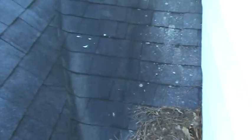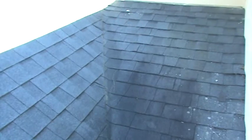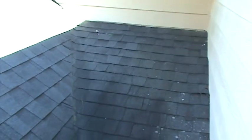And here's a skid right here, another toe board hole right through the shingle. That's an active leak. And everybody's been out here because in this corner, lo and behold, as I come around it here, if I don't fall on my butt, if I do, it was nice knowing everybody. This is the problem right here. They've lost flooring downstairs in this house 2 or 3 times already because this thing is flooded.